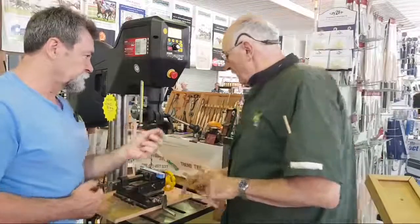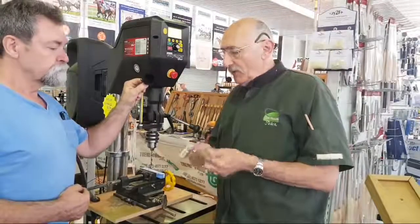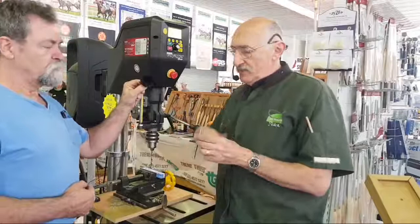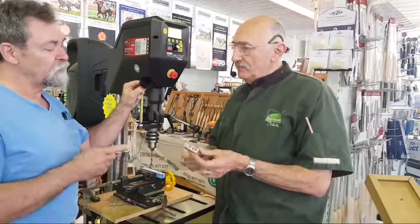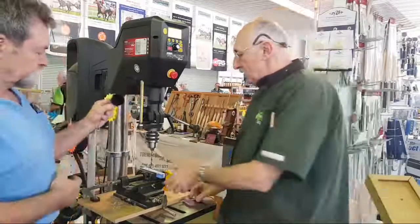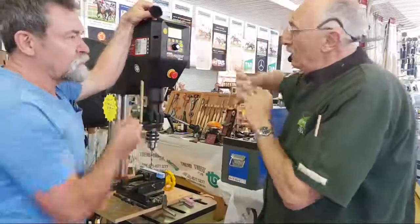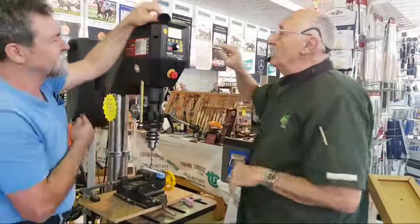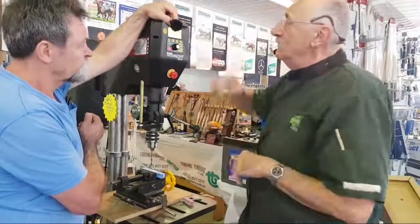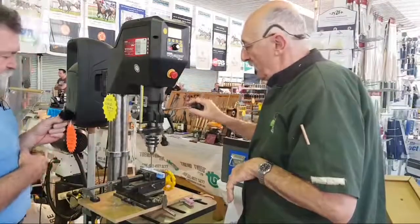Tell me what you're going to do with this. What I'm going to do is not only drill holes — this can do so much more. I'm going to tap a thread — not in metal or wood, I'm going to tap it in acrylic. People know how difficult acrylic is to work — it chips as soon as you look at it and does all sorts of weird and wonderful things. I've asked this machine what speed I should run at to drill a 7mm hole in a piece of acrylic. It's told me 2,000 RPM, so that's what we're going to do — drill that hole down there, and it's not melting at all on the bit.